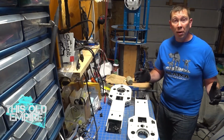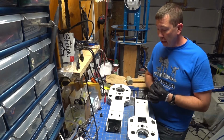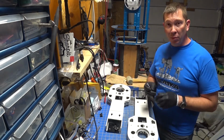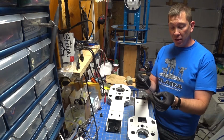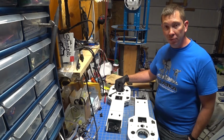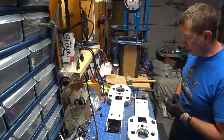Alright, welcome back. So what we did is we got ahead and got our 2 ankle details on. It was really easy. I don't know if you noticed, we use, again, hex screws, which in trying to get into these little tiny places can be a pain. I highly recommend these extended socket sets that have the hex on there. It is actually the perfect length to reach down inside there. You can use a socket wrench, tighten those, untighten those. Super easy, no frustrations. Just a little tidbit I thought I'd pass on.